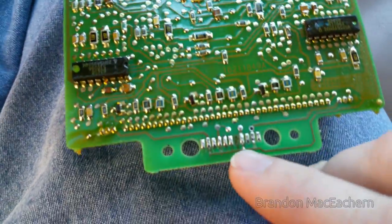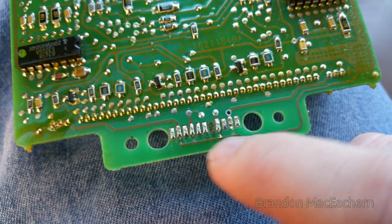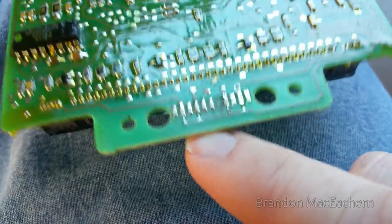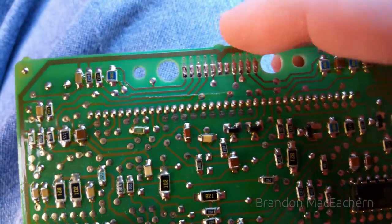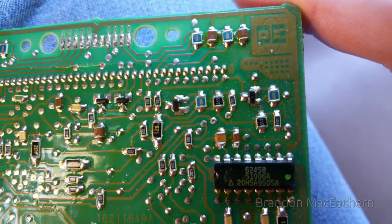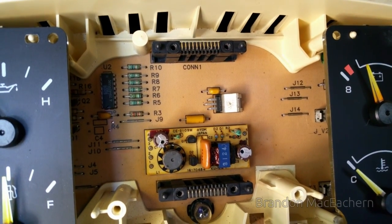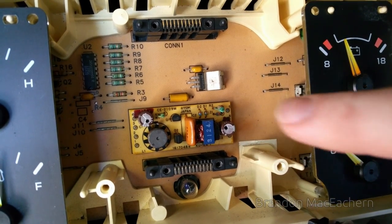This car has already been repaired at one point. The solder pads lift up very easily - I tried to reflow the solder to get rid of these little divots, but as I've learned, don't bother. The solder pad that lifted wasn't actually connected anyway, so that was okay. I'm assuming this one here, because it's all beefy, is probably the B-plus supply. Here are the actual springs - these are what the springs actually look like. This is what steps up the voltage to drive the B-plus.